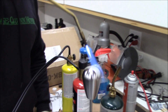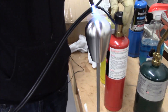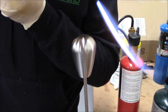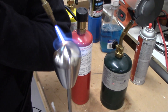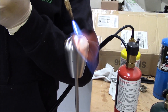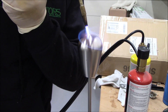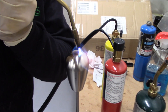Let's start there. Initially it's going to look like it's starting to burn, but that's where the gold starts to become a purple. A little bit of purple breaking through in the center there. Keeping the torch moving to not overheat any of the areas.